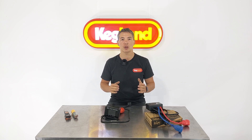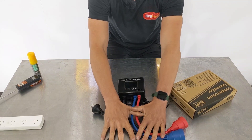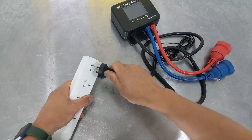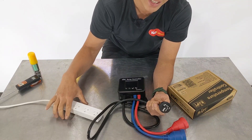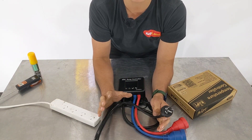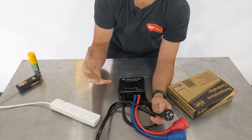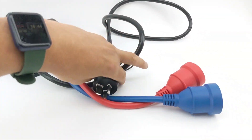Let's take a look at the difference. Because this is a 15 amp device, we have to make the cables a lot thicker, and most importantly the earth needs to be bigger as well. In Australia, 15 amp devices have a larger earth pin, so a normal 10 amp plug from a power board will not fit. Some of you might be tempted to grind the earth down, but please don't — that makes the product non-compliant. You'll need to speak to your electrician. Most modern Australian houses have sufficient wiring to handle 15 amp; it's just a matter of swapping the wall outlet over to a 15 amp one.